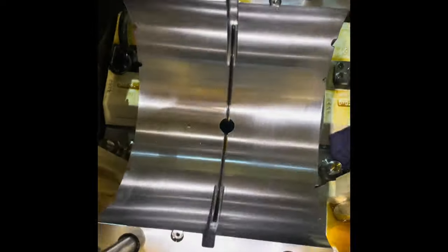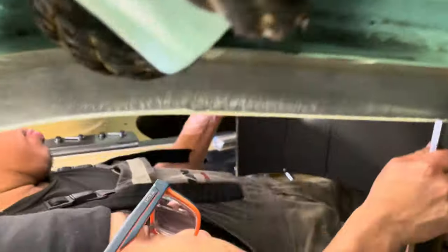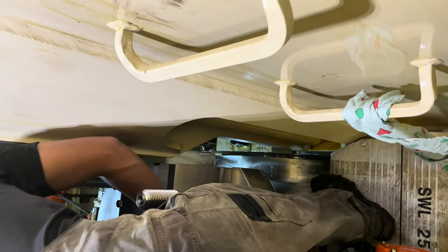Once cleaning is finished, inspect the bearing surface and lube oil passage to crank pin bearing and crosshead bearing upper parts. Please note here, I had damages to the lower part of the bearing only. Mostly it is a loaded part on the crosshead bearing.